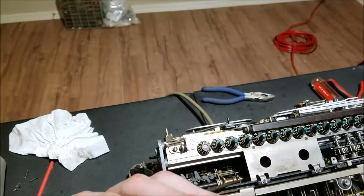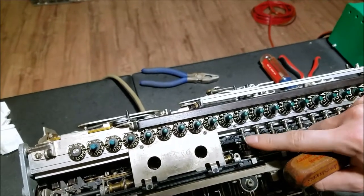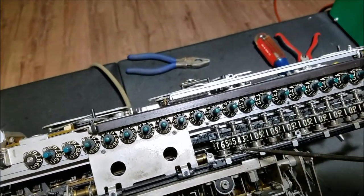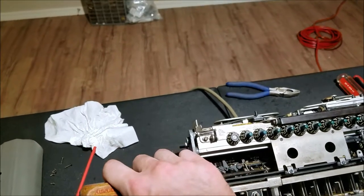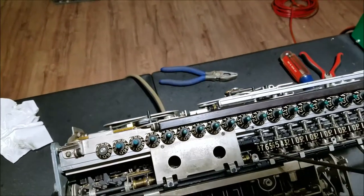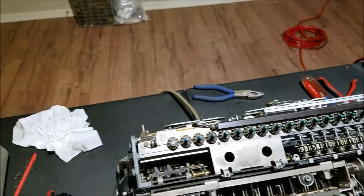When it wants to carry, there's a little cut-out on the bottom of each wheel. See the little notch right there? This pin will fall in that notch, and the little pin that moves here will fall in that notch and cause this pin to engage with these teeth right here and turn the next wheel one position. That was two positions, but you get the idea.